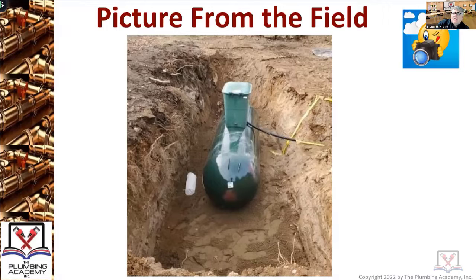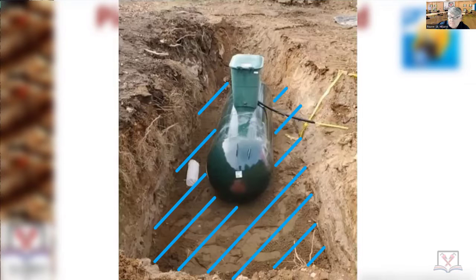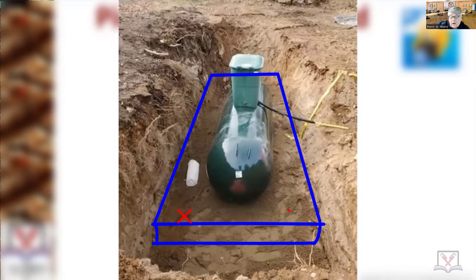Does anybody know what they're looking at in front of you right now? It looks like a single man sub — it looks like a propane tank. It's an underground propane tank. You see this kind of cover right here. That cover is at grade when this is all backfilled with nice sand. In some cases, in an area where there might be a high water table where water can come into this trench or reach the tank, they would have poured a pad and it would have had tie-downs where the tank would have been strapped to a concrete pad.